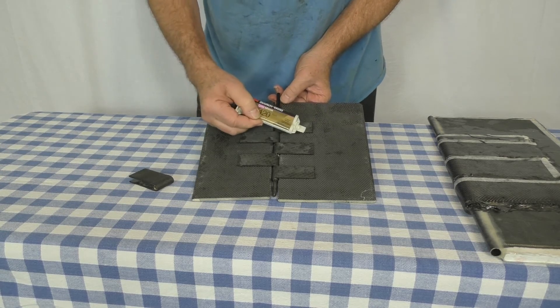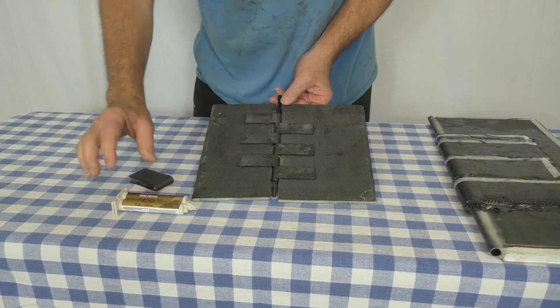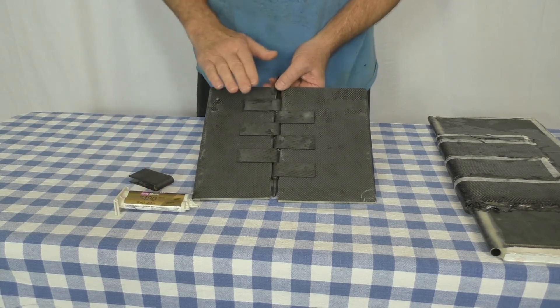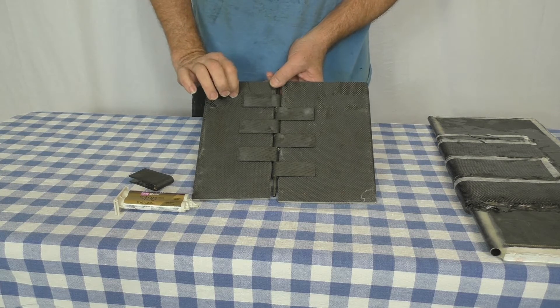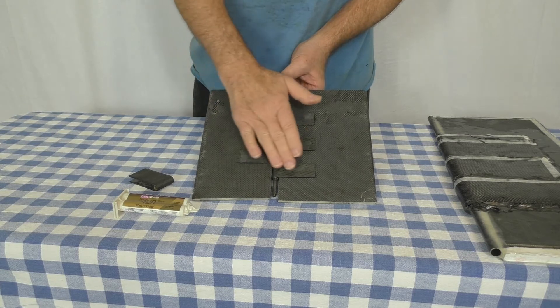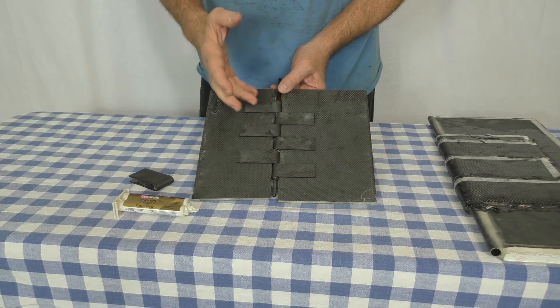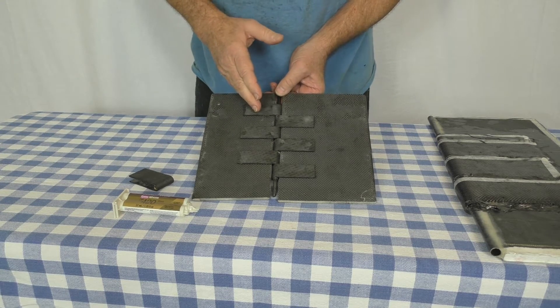But in some particular cases, that really high strength is going to be needed, and I'm willing to spend that amount of money to get that kind of bond strength. These lugs are simply bonded to the panels with this adhesive. I've calculated that there's sufficient square inches here to utilize the full strength of the lugs without failing the bond itself.